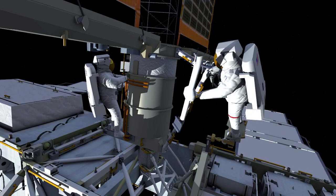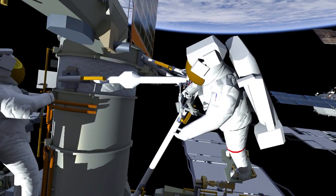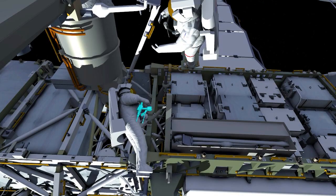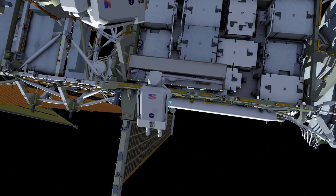Mark will work to soft dock the side pad on the BGA while Aki holds it in position. Mark will hand start his 4 bolts and then follow it with the PGT, and then Aki will drive his bolt to torque. The crew will then gather tools and reset for the right hand side. They'll bring the tools back to the strut bag and prepare the struts for handoff.